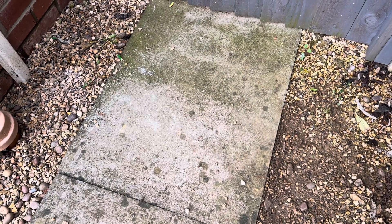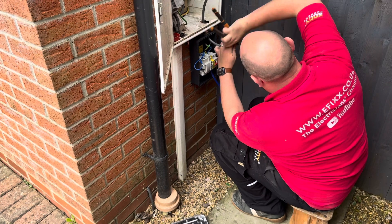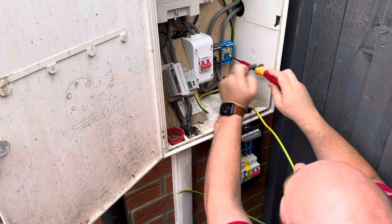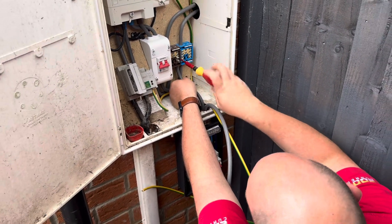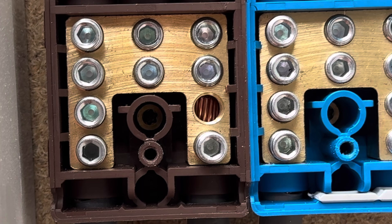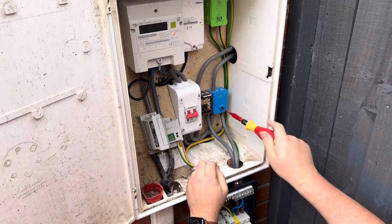It's time to wire this board up and I'm going to be using these flexi tails from Doncaster Cables, connecting into these Luden terminal blocks. I love these tails as it makes wiring so easy — gone are the days of wrestling meter tails into position. The tails go in a breeze, and if you're wondering why I removed the top screw, this is an old habit taught to me by my electrician when I was an apprentice. If you can see the tails on the second screw, you will have definitely hit them and you'll get a great connection. Let me know in the comments what your electrician used to make you do as an apprentice that you still do to this day.